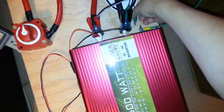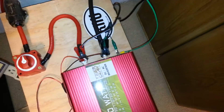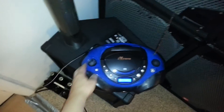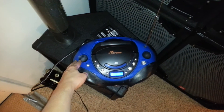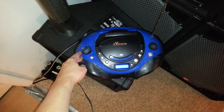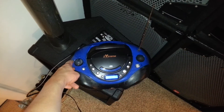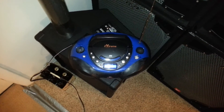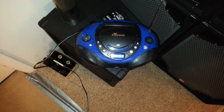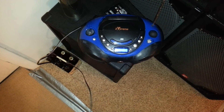I am now going to ground that negative terminal of the battery to the case, which is also connected to the ground rod. That clicking noise is from my camera phone. Now with the negative terminal of the battery grounded, here's that same 522 KHz. Little, if any, hash. If you were to use the S scale, I think that's more like S1, maybe S2. Before, without any of the filtering, it was more like S8, S9 — it was pretty strong.